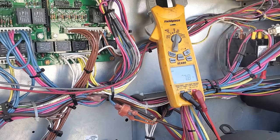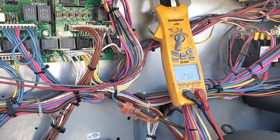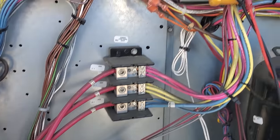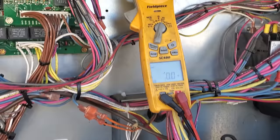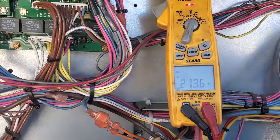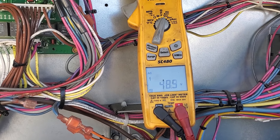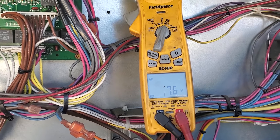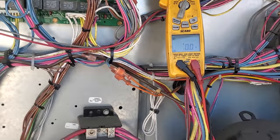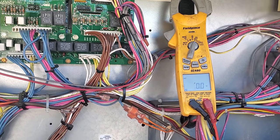112, 122, 122. That's a very odd voltage. So it's not going to be a fuse issue — it's going to be like a burnt bus bar or something. Line two to three, line one to two is 48 volts, and line one to three is 177. So we're going to take a meter and tools and go down to find the main breaker or main electrical panel and see if we've got a bad breaker, bad fuses, or what.